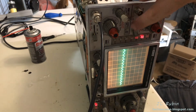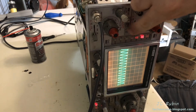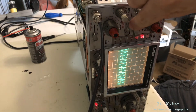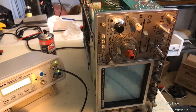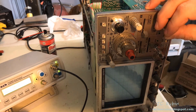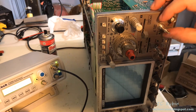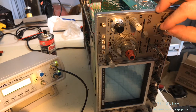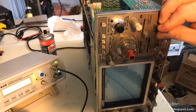Let's check the channel two inversion — channel two inversion works good. Obviously we're not going to see any bandwidth limitations at this frequency. One thing I did notice is these two knobs here for the trigger level — not the ones on top but the ones inside — are completely frozen for both of them. I find that very peculiar. I've taken the plastic knobs off lest I break them, and I'm going to try to unfreeze them with some DeOxit from the inside.